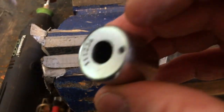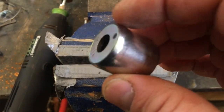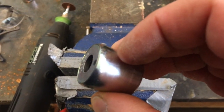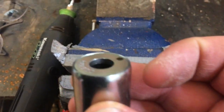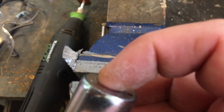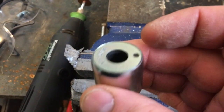We're going to zip-cut the crimp off the end of there. Really what's in there is an empty cup — well, it's not empty because it's got a coil in it, but it's a cup. There's a spool of wound wire in there. What I'm expecting to find on the end is just a washer — you can see that — it's just a washer, and that washer is captured by the crimp on the end. Actually the washer is loose in there; it just can't come out because of the crimp.